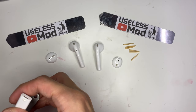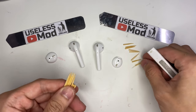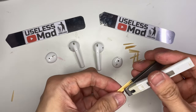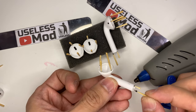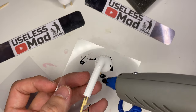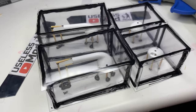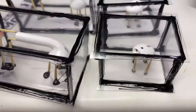Everything is disassembled, so now we can start making the mold. I selected a chopstick tip because it's pointy and round in shape, making it very good for creating the runner for the mold. I then stick them into the parts and fix everything onto a piece of clear plastic — you need to see the silicone run inside when pouring. The final setup looks like a very good art piece in an exhibition.